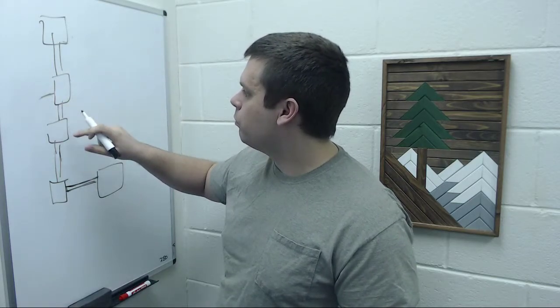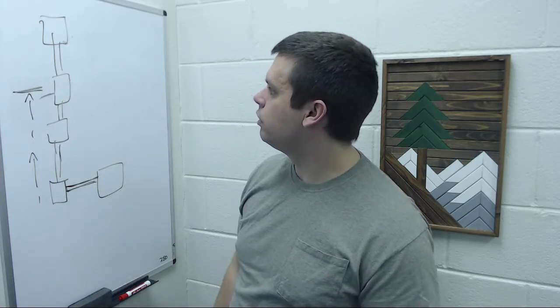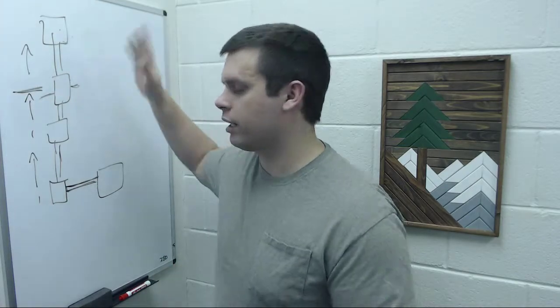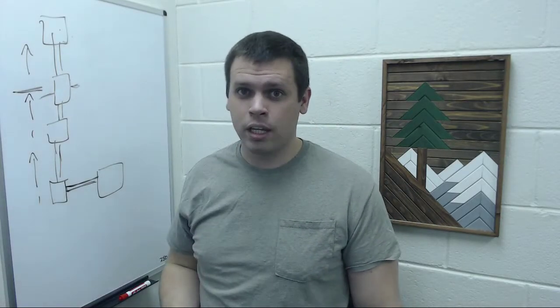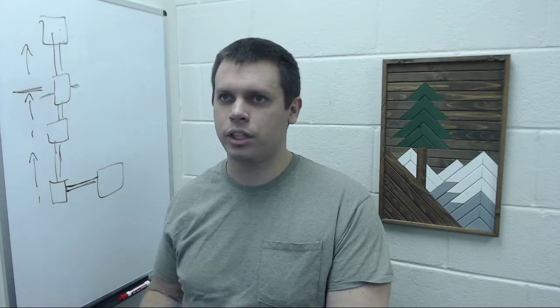So the problem with that was ultimately, you would send a byte of information here, and then it would just get dropped here. Something would happen where the data didn't get through, so it wouldn't send the data on to the next thing. By daisy chaining it like that, you just increase the likelihood of something going wrong, and then when it does go wrong, it can't recover. And then also I was using Arduino Nanos in the actuators particularly, and the Arduino Nanos only have 1 hardware serial port. And you need to use hardware serial if you're going to send and receive data.